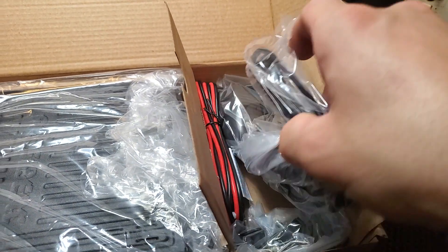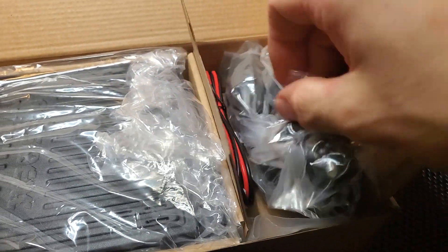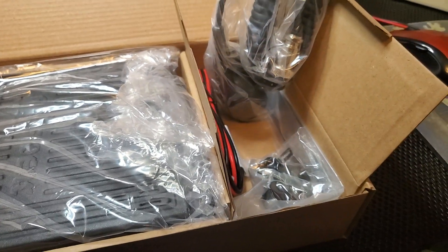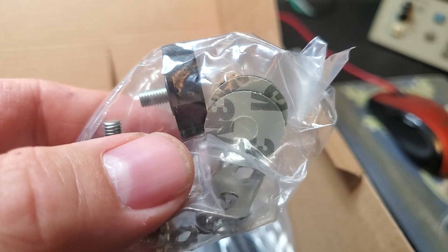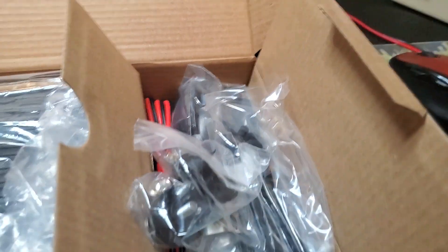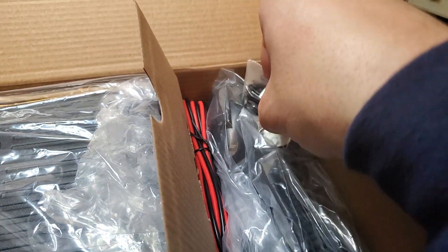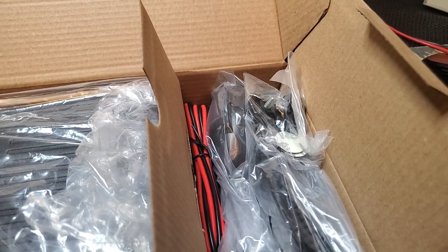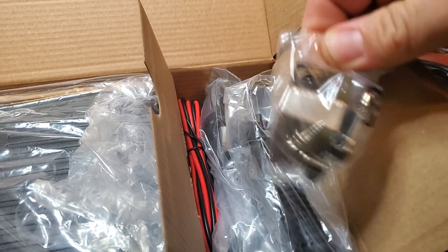Your stock microphone, power cord — all that good stuff is brand new, nothing's been removed. We're looking for these little things right here — they say 3M and have adhesive on the back. You pull that off and stick those to your mounting bracket, not to the side of the radio. What that'll do is when you take this in and out of your vehicle, or if you have it mounted on a desk in a base station setup, it'll allow the radio not to get scratched on its sides.